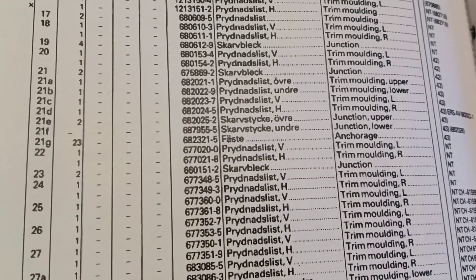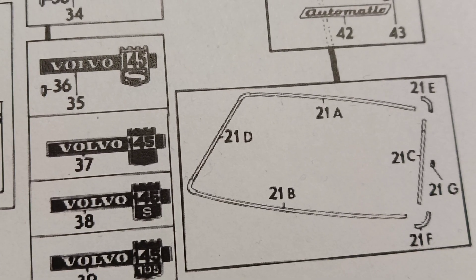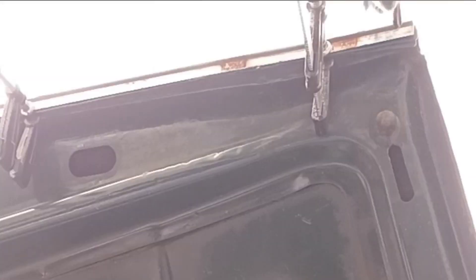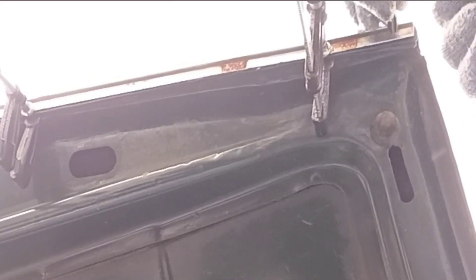I think the most important thing is to actually figure out where all these parts should be. For easily attaching, we can use these tools. Easy drilling one hole in two parts at one time. Now measure with this simple punch and hit with a hammer. Do not forget where we need to make the hole. Now we drill where the hole should be - don't attempt drilling without first making a mark, unless you're willing to scratch the plate.